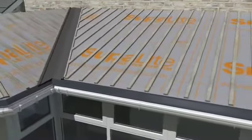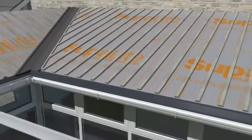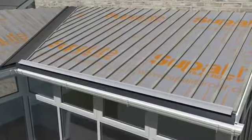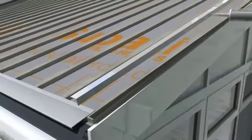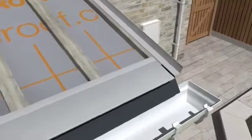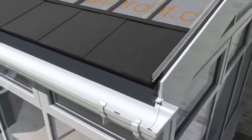Unlike other systems where the tiles are installed directly onto the plywood, these battens ensure constant airflow and eliminate any problems with condensation under the tiles. At this stage the metal tile starter cleat is added. The barge soaker is attached directly to the battening using high quality adhesive. At this point of the roof installation the tiles can now be fitted.